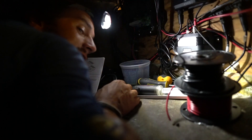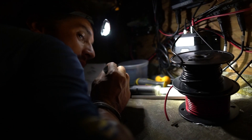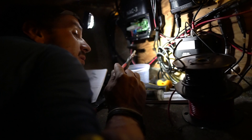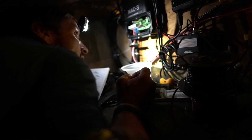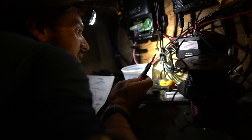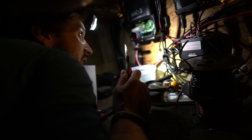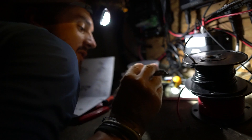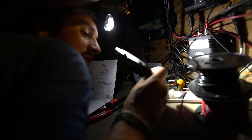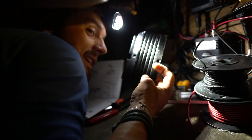The sun's gone down but that doesn't mean the workday's over. Up underneath here, above our pilot berth, I've got the AIS already installed and I just installed this NAC3 autopilot computer — it's the brain of what runs the autopilot control. I'm just wiring it up. It takes power in, it connects to the NMEA 2000 network, and then it's got a power and switch out to the autopilot ram. One of the cool things about this is it's actually waterproof. It has covers and gaskets, and small details like the screws that hold the cover on are self-retaining — they don't just fall into your bilge. It's little things like that I notice.